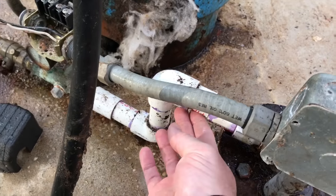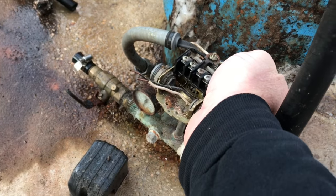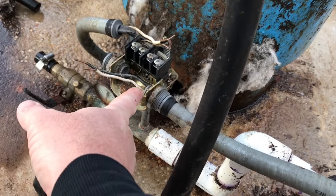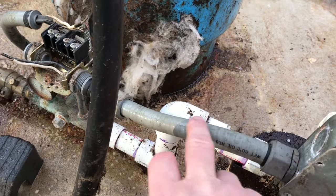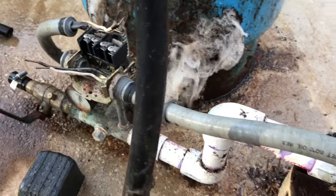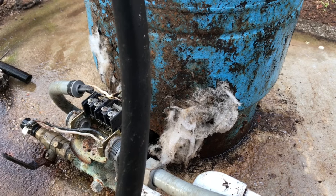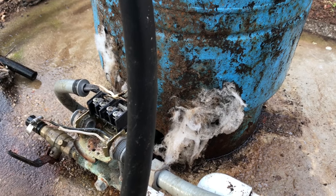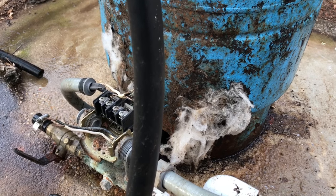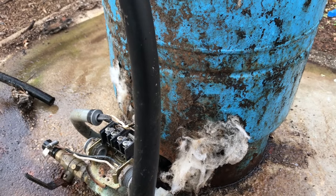I've already got the pipe cut loose here at the well pump and our wiring harness taken out of our regulator and laid out of the way — that's the one coming up from the ground. We're going to wiggle this unit a little bit to work this wire out of here, because we've got a short piece of conduit that's not very flexible. We've already got our line cut loose over here, so we're going to wiggle this thing out of place and get ready for our new one. One more tip: go ahead and cut your hot water heater breaker off, so in case the water level in your hot water heater goes down and it kicks on, you don't want it trying to heat air — it could do some damage to your hot water heater.